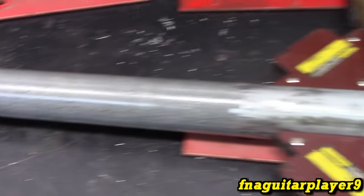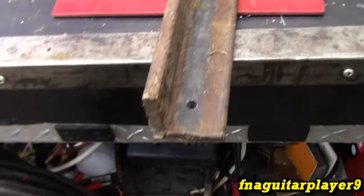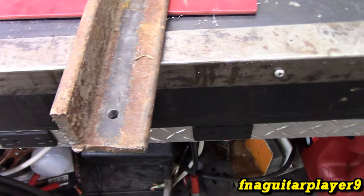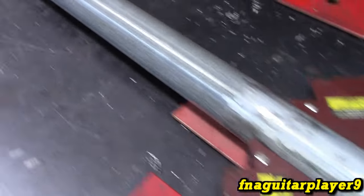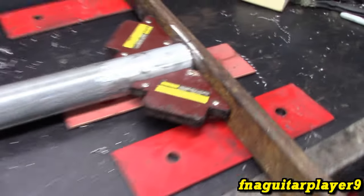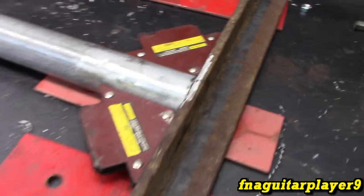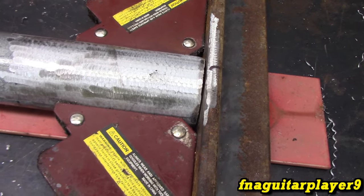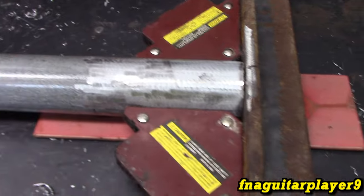Working on the carriage part - where's the carriage going to ride? I got this big steel, it's 3/8-inch thick - a little overkill - and it's 2 inches like this. I already drilled the holes in it for the wheels, getting ready to weld the support to it. I also have the same bracket underneath it back here for support. Going to get it welded up and go from there. Already ground everything down and got all the galvanized off that needs to be.